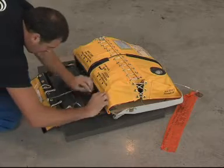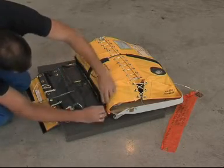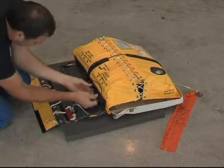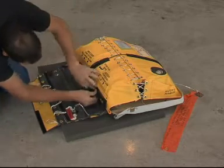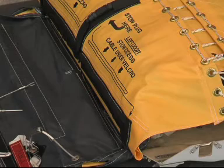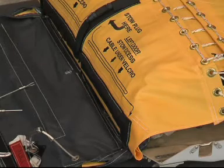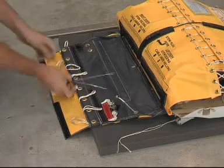Place the electrical wiring according to the side that the slide needs to be installed on. The electrical harness must come out of the side of the girt assembly in the flight direction. To place the harness correctly, follow the instructions on the pack assembly. Now the pack assembly is ready to install the girt bar.